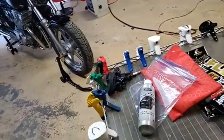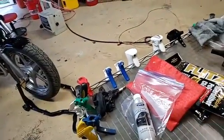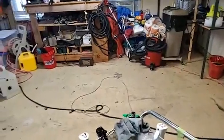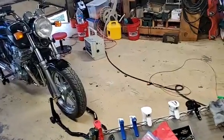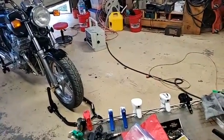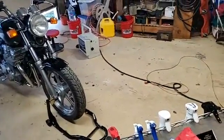Oh, man. And when you get through and you apply this stuff with a little microfiber rag they give you, you see them up there, you have to air dry them before you throw them in the trash, because as that stuff dries, particularly on cloth, it generates heat, and they say there is a possibility of a spontaneous combustion in the trash can.